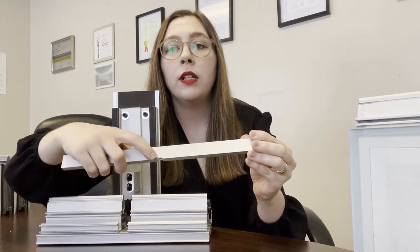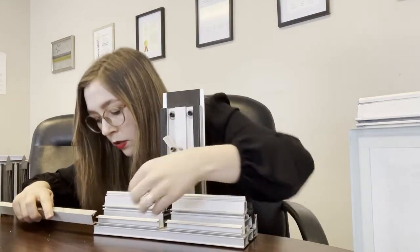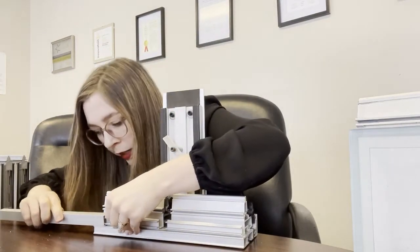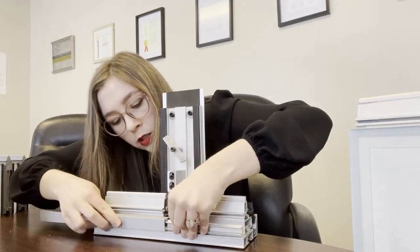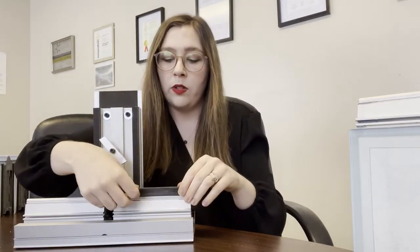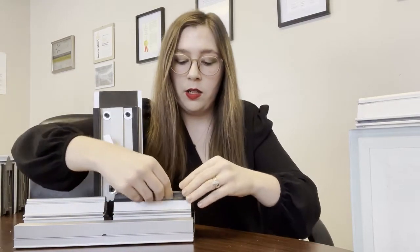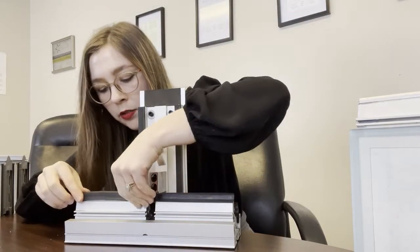Okay, so then you have your sill cap, and there is a hole in here as part of the rain screen system. The way that works is it just slides into place, just like so. And so then you have your U gaskets, and they go on top of the starter. You want to make sure those are level and in place properly. And the other side.